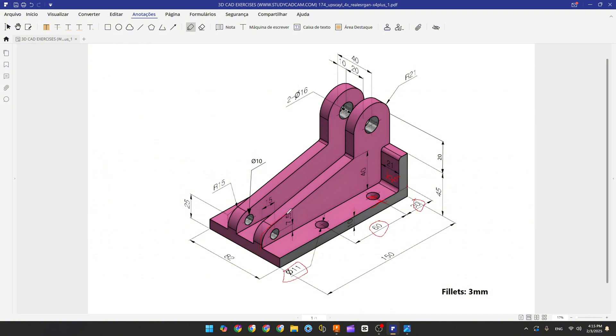Now let's create this profile. We'll make a line with 25 millimeters for the distance from this point to this edge, and another line. This point is 40 millimeters from this face. The distance between these two points is 42 millimeters — the radius is 21, so 21 for each side. The distance here is 42 millimeters, and the center of this arc and this circle is 20 millimeters from this edge.